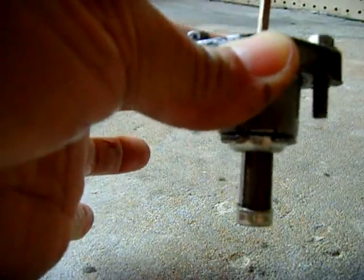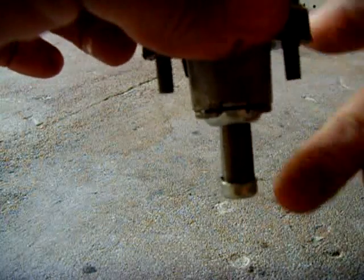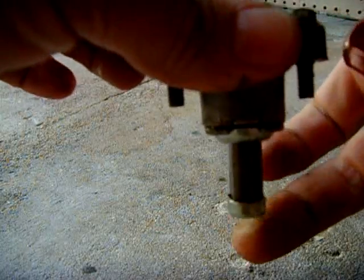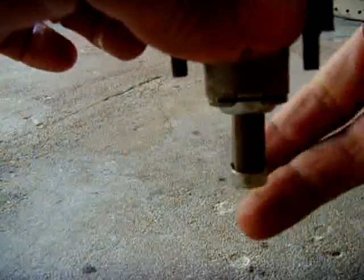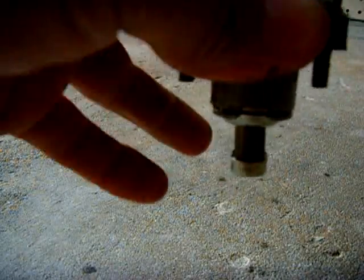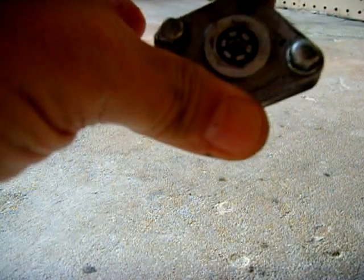Put it in the hole, then let it release and it goes straight down. The problem with this type of thing is once it extends you can't push it back in, so if you put it in like this it's gonna be too tight. Tighten it first clockwise, put it in, and slowly release the screwdriver — and that's it.